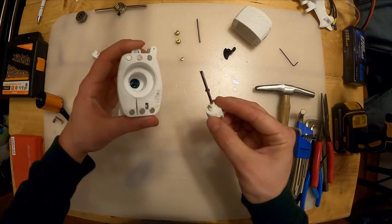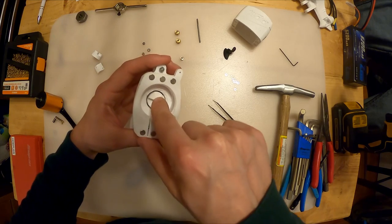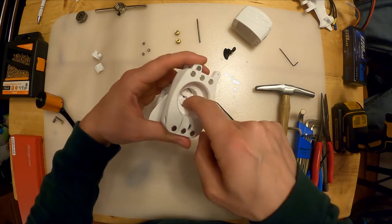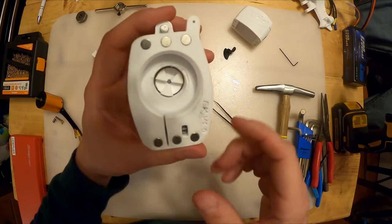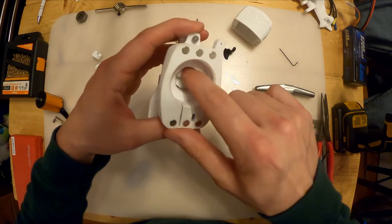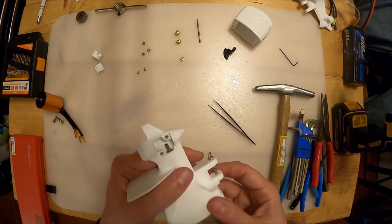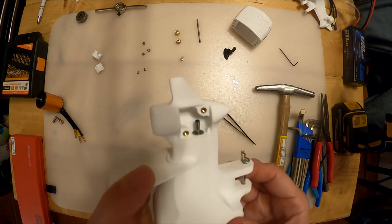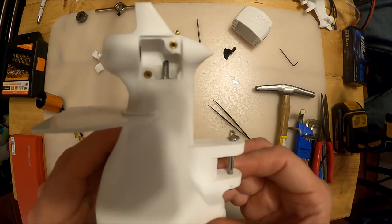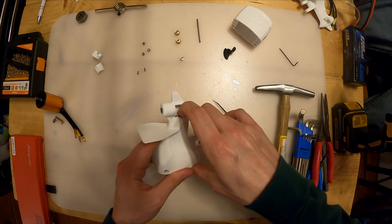All right, take two. You're going to push that down through the shaft - this should fit down nice and flush. There should be no rubbing and you should be able to easily rotate it with your fingers. See how we've got clearance between everything, it's nicely rotating, and it went all the way through. That's perfect. You'll notice the 8mm flat is down there.